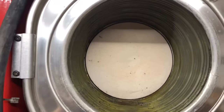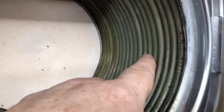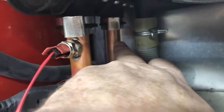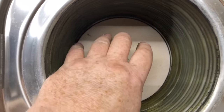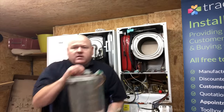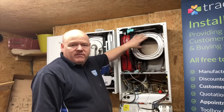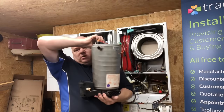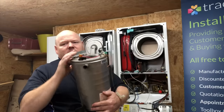Looking inside the heat exchanger, the burner allows heat to come out into the chamber. There are pipes inside — a flow pipe at the back goes into the heat exchanger and around, then back out the return pipe, transferring heat from the combustion chamber into the water. Different boiler manufacturers use different heat exchangers — a Worcester unit shown here allows the burner to be removed from the front for servicing, though its downward-facing connections make access a little trickier.